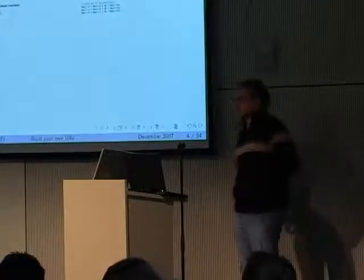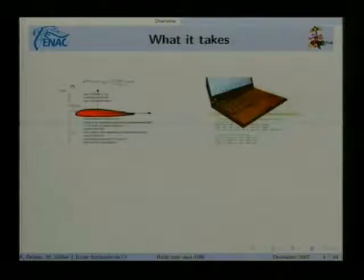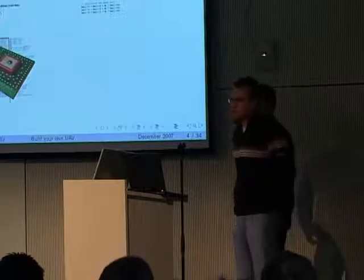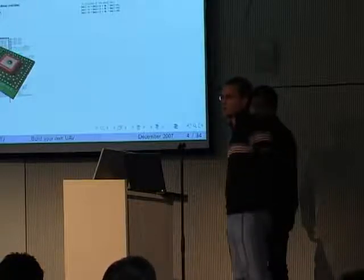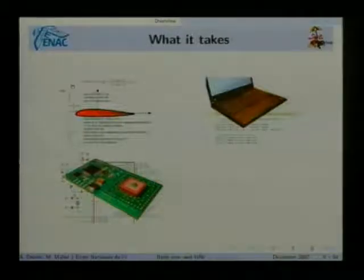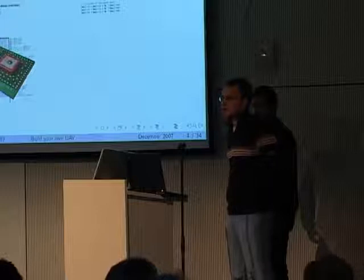You probably have some control loops which you will use to control the aircraft and the autopilot. You have to push all this information, all these formulas, into some computer. You have to have some knowledge in computer software and how you operate that, and you put that into software. Then you have to put this software into the aircraft. You have to have some hardware, some electronics. You probably need some skills on how to operate a GPS receiver, how to integrate antennas, and you probably also have to make sure that the telemetry link or the video link doesn't disturb the GPS, because that's most likely the biggest problem you will have, especially with such small aircraft, that you have a lot of interference between the devices that you have in the aircraft.